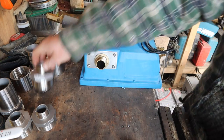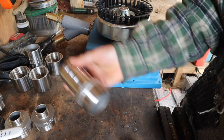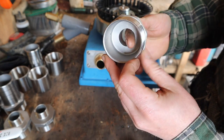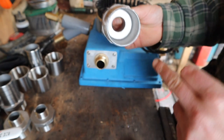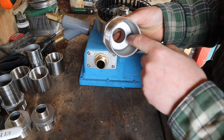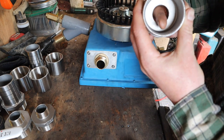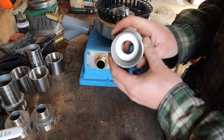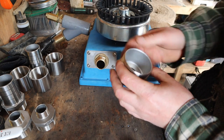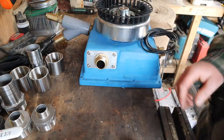I have to reduce down from two inch to one inch for the nozzles. I was hoping they'd have a bit more of a chamfer in here, because water hitting a dead wall and having to turn the corner is a loss point we don't want. I'm probably going to machine and press in some tapered inserts that direct the water smoothly — either brass or stainless — pressed in at a later date when I can borrow a friend's lathe.